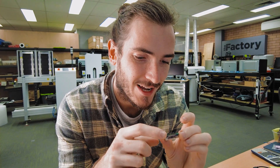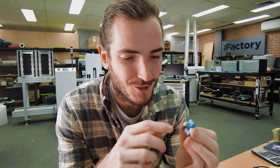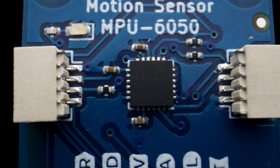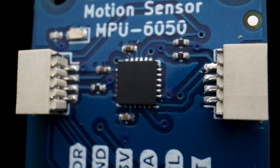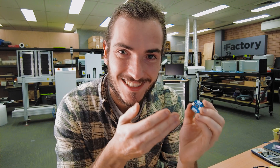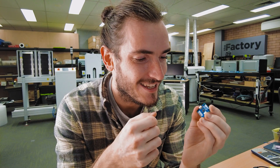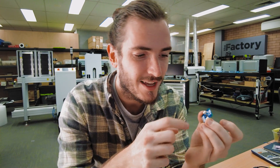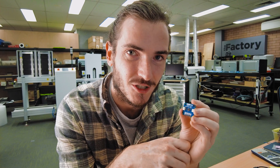So this prototype is essentially done. This is version 0. We actually took this one up another version because in this iteration we placed the part upside down, which didn't seem to matter at the time but of course this device is directional. So in the updated version we've rotated it so it matches the orientation of the board and also added some silkscreen legends to show you which axis is in which direction.